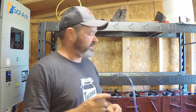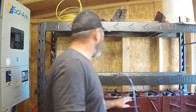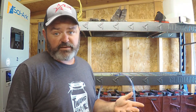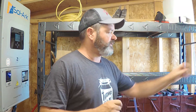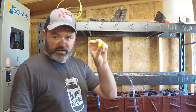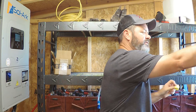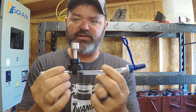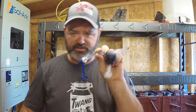Because the batteries off-gas during boiling, a little water evaporates and you end up low on water. Instead of going through every single battery — each one has three caps and we've got 16 batteries — we replaced those caps with valves from a company called Battery Watering Technologies. We got these from Scott Hunt at Practical Preppers LLC, and he recommended them. I'm so glad we have them.